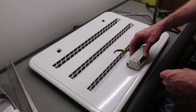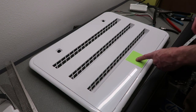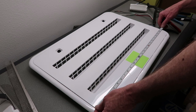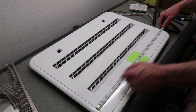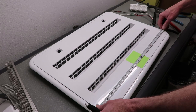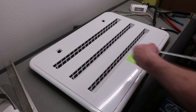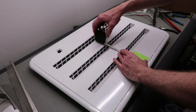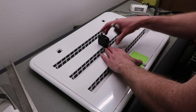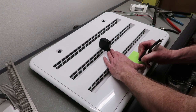I'll install it right in the center there. I put a little post-it note — we are at twenty-two and three-quarter inches, so that's going to be eleven and three-eighths as half of that. Let's mark the center top to bottom — we are at a little over three and a quarter, so about half of that is one and five-eighths.